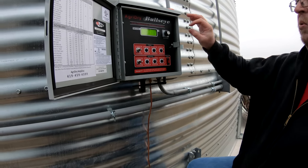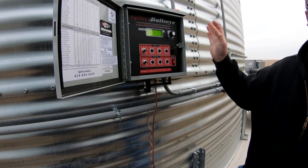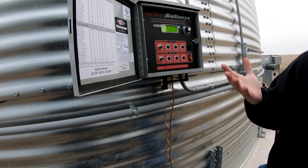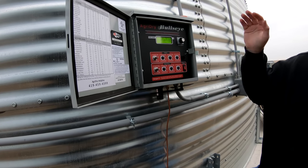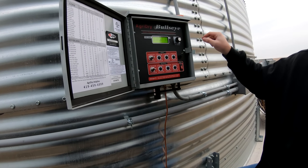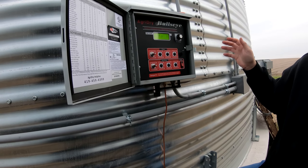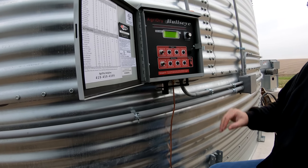EMC limit — say next year you dump 17% or 18% in the bin, which it will handle readily because you've got your corn out fairly early compared to a lot of people. The earlier you get it out, the longer a window you give mother nature to work with you. The EMC limit is the limit that it'll dry plus/minus to dry. The CEMC value uses the temperature in the bin when you're drying — so if you dump out of a bin at 85 degrees for some reason, the moisture capability of that air is higher than what the air would be outside.